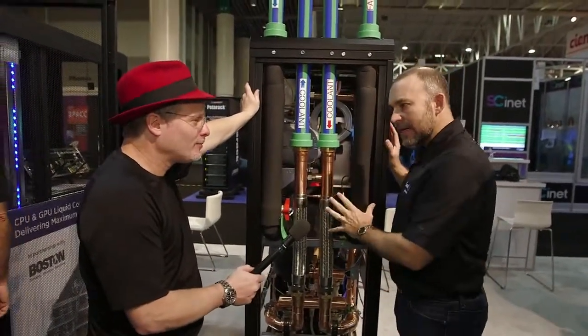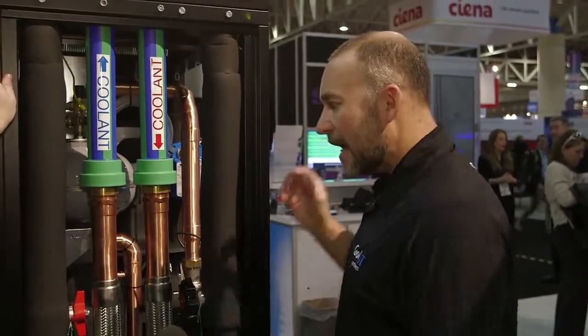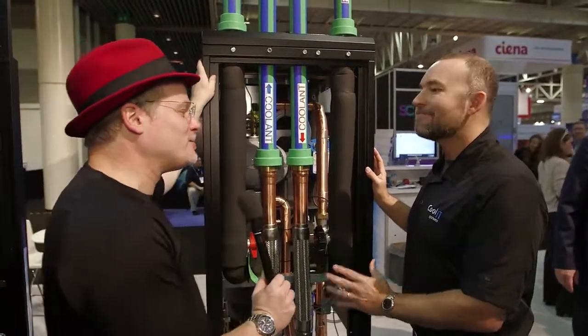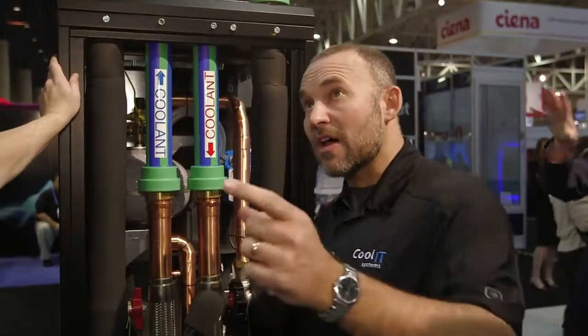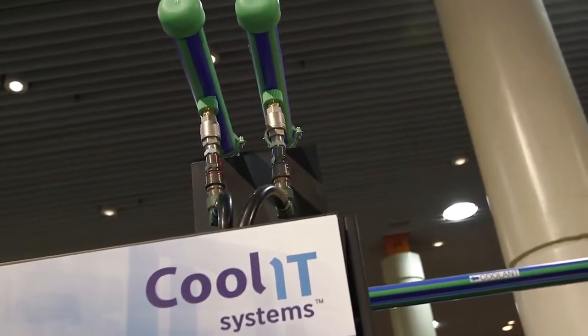This device could cool a pretty good-sized data center with facility water fed to it. The advantage is it takes all that high-pressure facility water — 50, 60, 70 PSI — and it's nice to have this remote and away from the racks. This can be in another room entirely, so if you want that high-pressure infrastructure abstracted from your expensive IT equipment, you can put it on the roof, in the basement — wherever. And when delivering coolant out to various racks, there are options for disaster recovery, including manual or electronically controlled valves to isolate on a rack-by-rack basis.